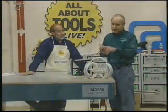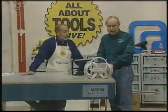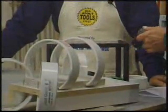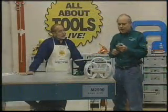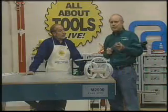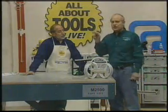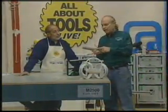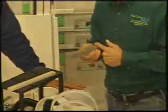You'll see the squeeze out on the back side. Now, what happens on this rail is that you'll have squeeze out. You'll need to hit it with a file, run it through your table saw, and then you'll end up with sticks like this to put on your deck. Now, there's an advantage to this because you don't have to worry about how thick your substrate is. Whatever substrate you buy, you can cut your front edge. The other thing is you're going to have a factory finish as your front edge. So all you have to router off is the 1/2 inch deck instead of a full 1 inch of material. Makes sense.